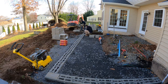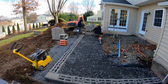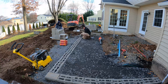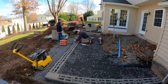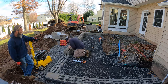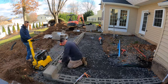This is our second course of wall block — these get glued and pinned; I'll give you guys a close-up of that in just a second. This course goes much faster than the first one, as you can see. You're basically just setting the blocks. The only thing you need to keep an eye out for is making sure you're staggering your seams. Each manufacturer is a little bit different — they'll tell you to maintain at least two to three inches, sometimes four or five — so you want to just keep an eye on your seams as you go.